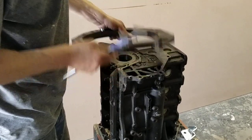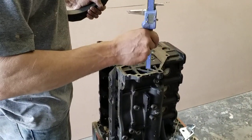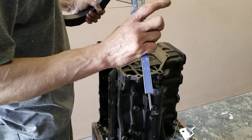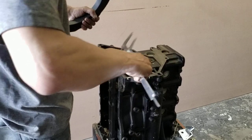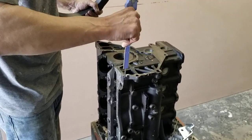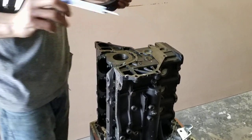Use the adapter plate as your deepest position. You've got basically three points, and that's roughly a 110mm diameter circle which you're going to draw through those three points. That's the main material that must be removed there.